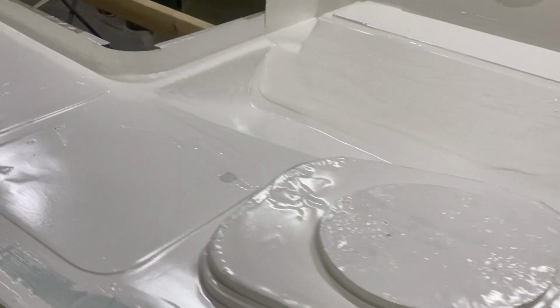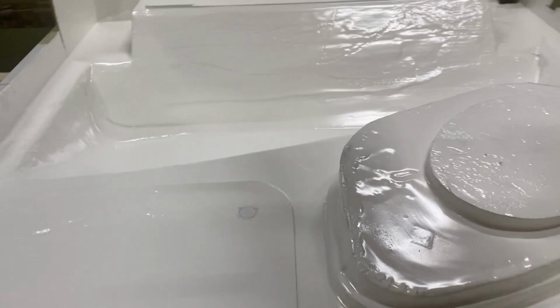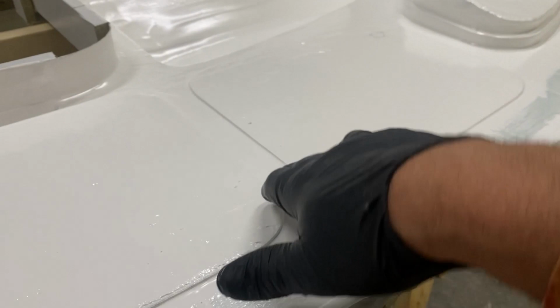I'm devastated. It's late. And I thought that two coats was going to be good. Well, it's not two coats, so it's two coats there. But I'm just not happy with around here. I'm not confident that if I cut the glass small, it'll go in. I just want it to be spot on. So I'm going to do another layer of gel coat.